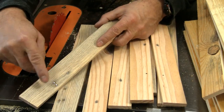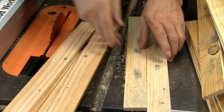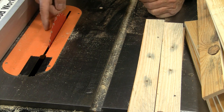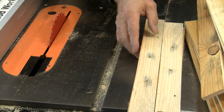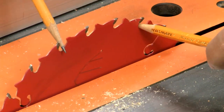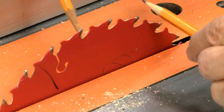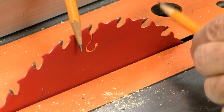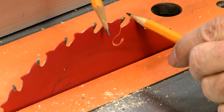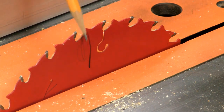Here's exactly why I didn't want to use my band saw — I ran through nails on several of those pieces. But this is why I love using these blades. I'm going to show you a close-up: I just ran through all those nails and there are all of the teeth — not a tooth missing. That's what I love about these little Freud Diablo blades. You can run through nails with them. I don't recommend it, but if you inadvertently hit one, in most cases the blade will survive some nail hits.